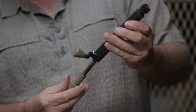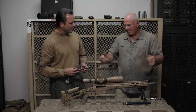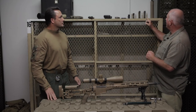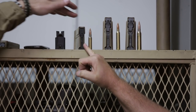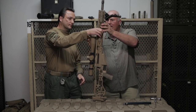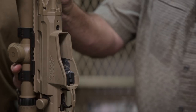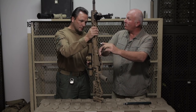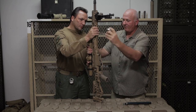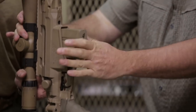The little screw there, which looks like a screwdriver slot, is actually a line indicating downrange. Slide it in there, ensure it's flush and pointed downrange, then insert the firing pin with the two-lug lock system — just that little eighth of a turn again. No need for a dime like the old system. Reinsert it into the gun. Now, taking note between the two long .300 mag and .338 magazines versus the shorter .308 — we're going to insert a magazine block. We simply stand it up, slide it into place with a captured screw, lock it, and torque it to 65 inch-pounds using the same wrench that also removes the action from the stock. Now that's inserted, it's ready to receive the .308 10-round magazine.